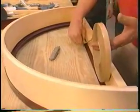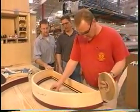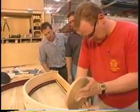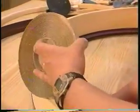Well, Jack, we've got our window basically framed up. What are the final steps before we drop the glass in? Well, here we are in final assembly, and what Gary's doing right now is laying down a bedding tape on top of our glass leg. Yep. Once he lays his bedding tape down, we'll be able to put a couple dabs of caulk in the corner, and then we will go ahead and bed the glass.